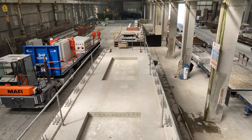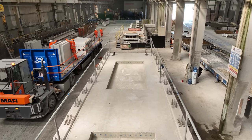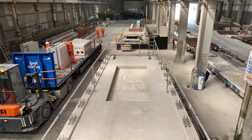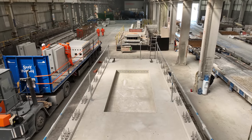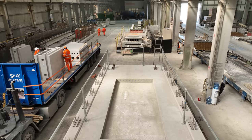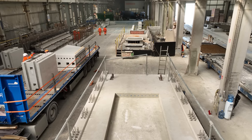When we finally lift this in, it's lifted with a lifting beam. We can't lift this unit with chains — we need to lift it vertically because of the potential for the deck to buckle in on itself. We lift from the wire straps which you can see on either end — two down there and two down there — and then we have a big lifting beam which goes over the top, with chains coming down, which allows us to lift the unit vertically.